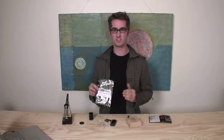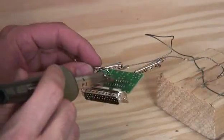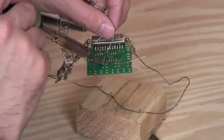Okay, let's get started soldering this up. There is a great satisfaction in soldering things together — you put things together and connect them with the solder and there's something really cool about doing it. I highly recommend it. Just don't touch the soldering iron, don't drop it on your rug, and enjoy it. You also want to make sure you hold the soldering iron onto the parts for a few seconds before you stick the solder on there so everything gets heated up — that way it makes a good solid connection.